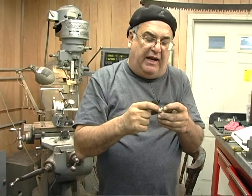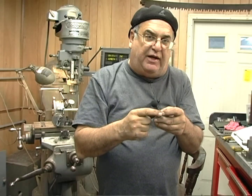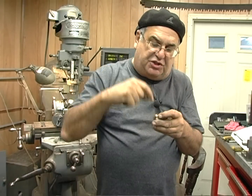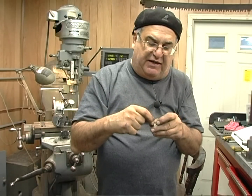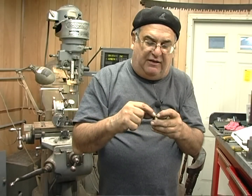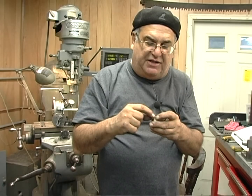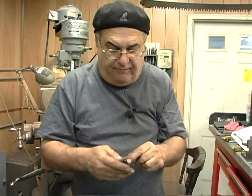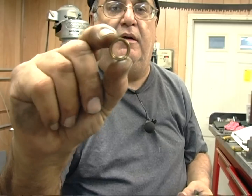I like that pop sound and that has a lot to do with how close this ring is. The closer this ring, the quicker it'll pop and then of course the shutdown. So this is an important thing on the safety valve. It won't make a difference if it wasn't there, but it does make it nicer. And what I found out is that the counter bore in here, that little counter bore, is too big.